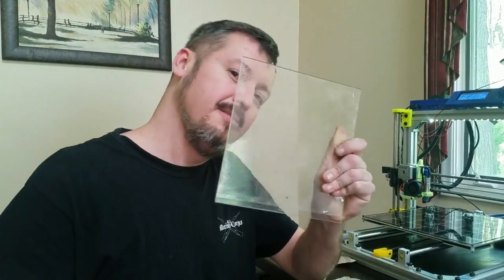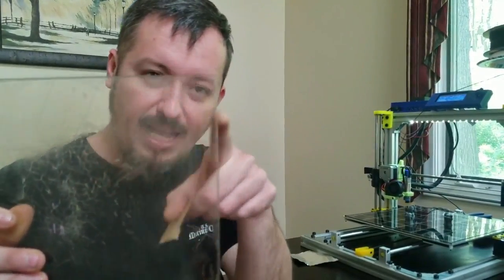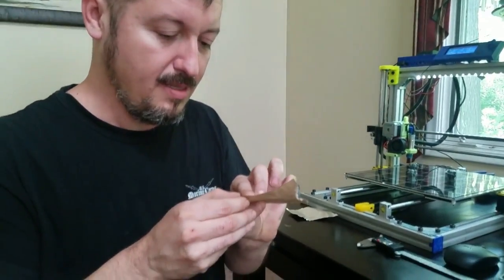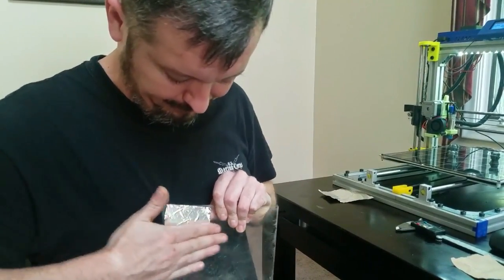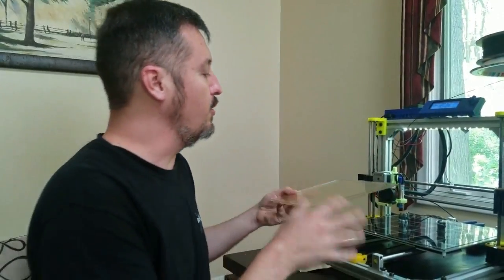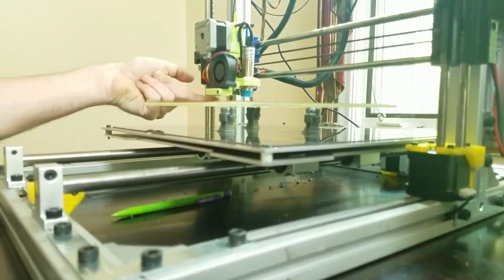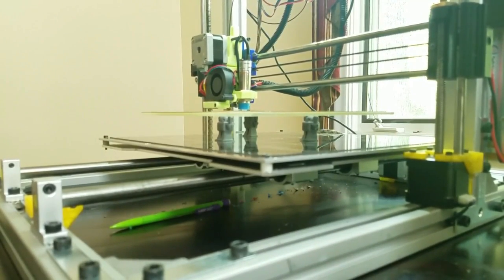Time to put my money where my mouth is. This is the bed from another one of my printers and this is a sensor from my current printer. I'm going to grab the aluminum foil and stick it to the bottom side of the glass. I'm putting this offset — not beneath the nozzle, because my machine is already calibrated. My little helpers will hold the piece of glass right out of reach of my nozzle but still under the sensor. I'm going to go ahead and send it home — oh look at that, it worked!